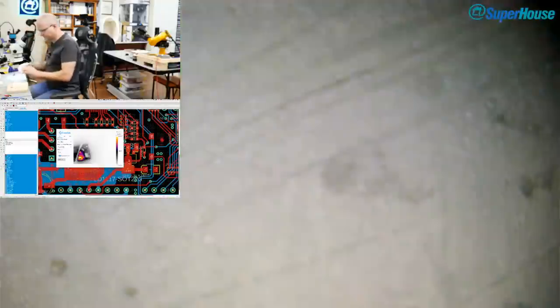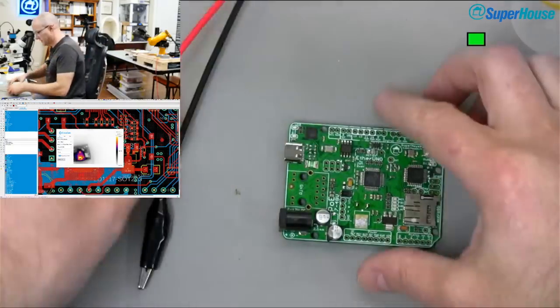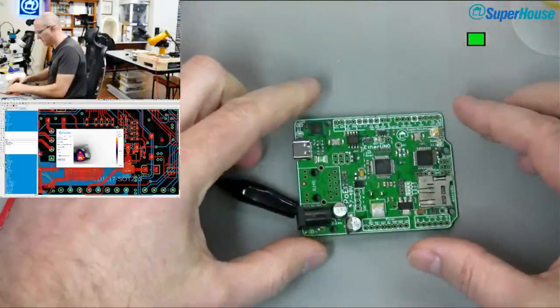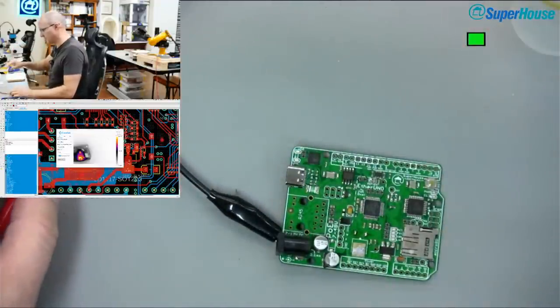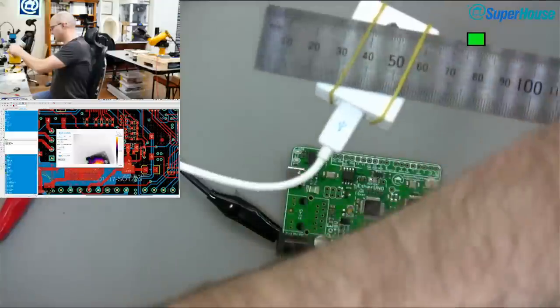All right, so let's see if we still have a short circuit, even though the voltage regulator has been removed. Overhead, yep, all right. Let's do that same thing again. I'm going to connect ground to this particular point, which is the ground point. And I'm going to turn on the lab supply. And just because it's a cool thing to do, I'm going to stick the thermal camera back on it.